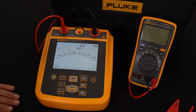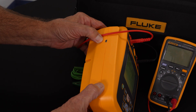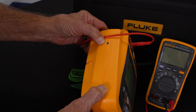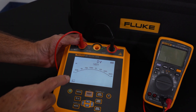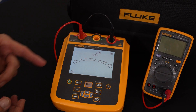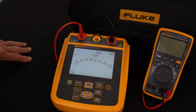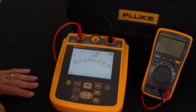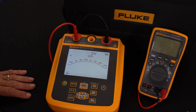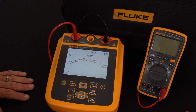Once we've stored all the results, how do we get the data out of the box? We supply a USB cable and it downloads to a template. The template shows the name of the device tested, the final reading, the voltage range, the leakage current, and the capacitance on the line — and it puts that into an Excel spreadsheet template, which is very easy to use and analyze. Excel will allow me to graph things, so I can graph the results over time.